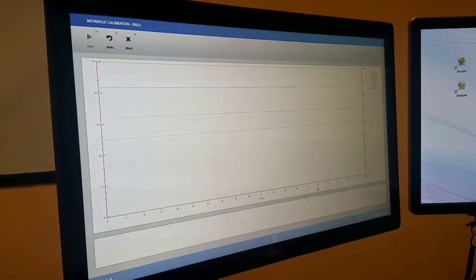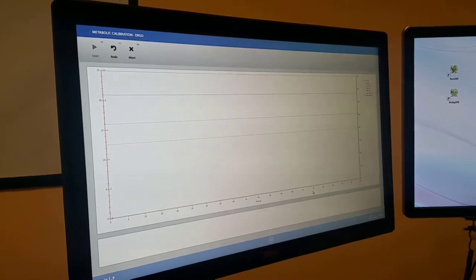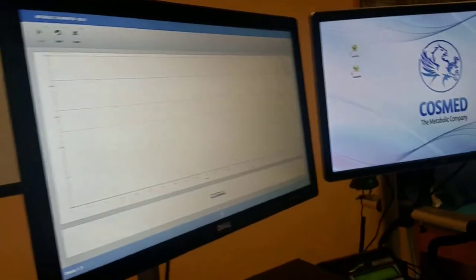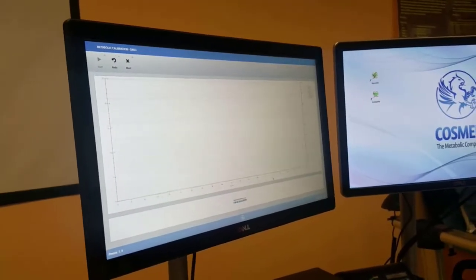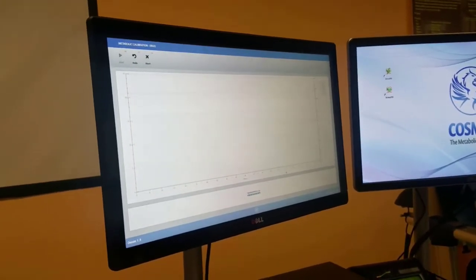So there's like three or four potential things that could cause you to fail. So one, there's less than 200 PSI or less inside of the actual gas tank. Two, the bar pressure is not set appropriately. Three, the sampling line could be bad.